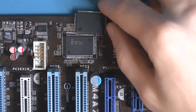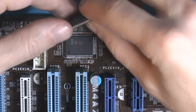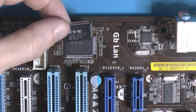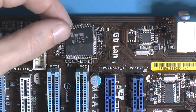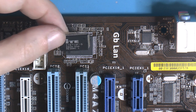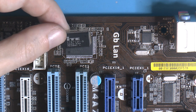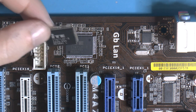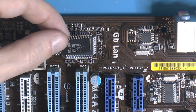It's quite annoying to get off actually, because they use lead-free solder on these boards, and it sunk a lot of heat even with the board heater, and I don't want to rip the pads. I want all that solder to be fluid, and it took a lot of heat. So I think that's also why this one blew up, because I had higher temperatures than I usually do, and a lot higher airflow. I should probably not use the nozzle, but then you can't really see anything. Then I have to film from the side, which kind of works.